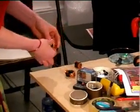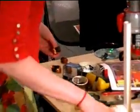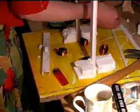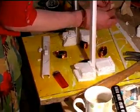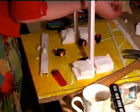These, as the stator, are going to go on the base — this is the stationary bit. You want to center these. This wire, as I said, is enameled, so I'm just going to scrape off the enamel. It just turns from a very metallic bronze to almost a whitish metal.